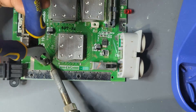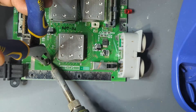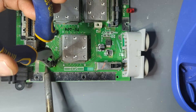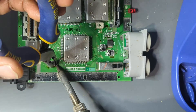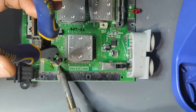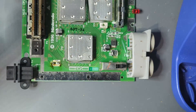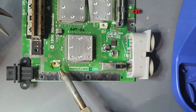It's starting to wobble a little bit. There are some soldering irons with two ends made for this — almost like a tweezer type — but I don't have those, so this is what I'm doing. Since these are coming off I really don't care about them, I'm not trying to save or salvage them, so I have no problem destroying them. And there goes one. Kind of a messy process — I have my heat pretty high. A thicker tip might actually work better.